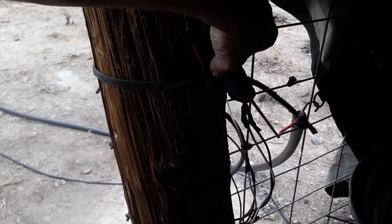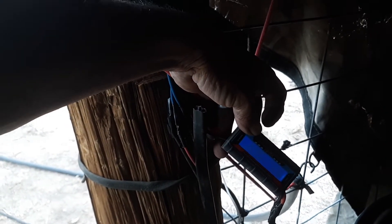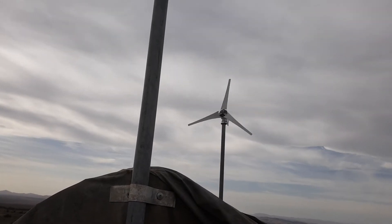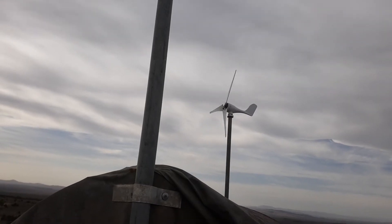I've got all bits of wire and whatever else I've recycled over the years. Both turbines are mounted there, with the wind turbine charge controllers mounted right there for the ones on here. That's the amp meter and watt meter for the wind turbines so I can see what they're actually producing. According to the specs it's 20 amps, and today with some decent gusts I've seen 15 amps, which I'm quite happy with.